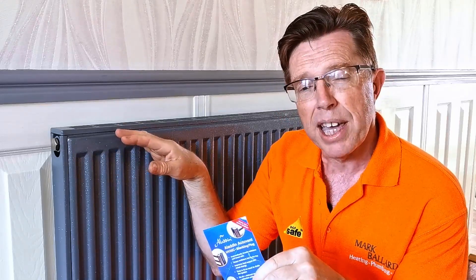On the other hand, if you have a combination boiler, your system is nice and clean, and you very rarely have to vent your radiators, then these would probably be the perfect answer. They're going to keep your radiators topped up to the top, and you can have a nice warm efficient system. If you decide you want to buy some of these Aladdin auto air vents, I've left the link in the description below.